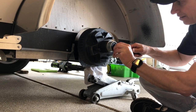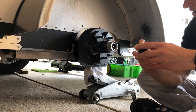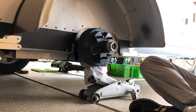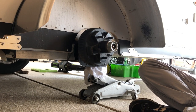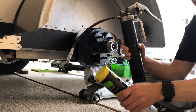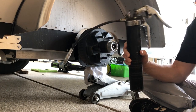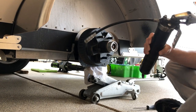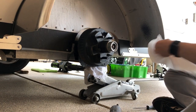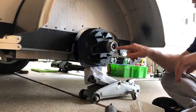If you take a screwdriver and get in there, you can just pop off this rubber gasket. I'll set that down for now and grab my grease gun. I'm using some high-temperature grease — this particular stuff is high-temperature heavy-duty grease made by WD-40, but there are a lot of different varieties of grease you can use. Go ahead and take your grease gun, clean the edge of it off with a paper towel, and stick it on the grease zerk — or the nipple.